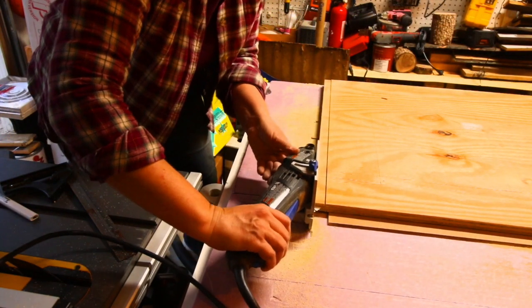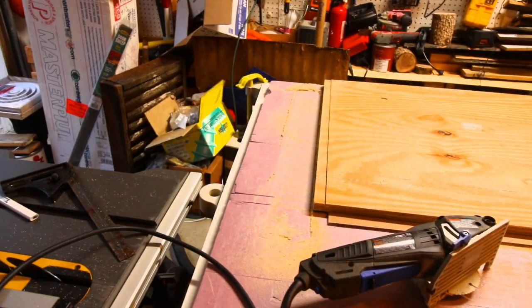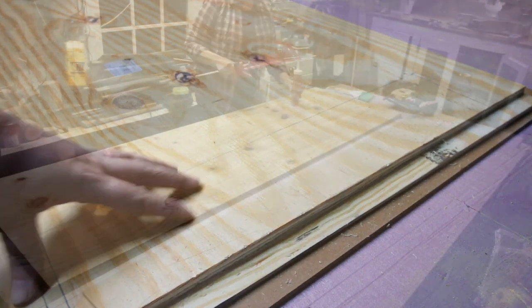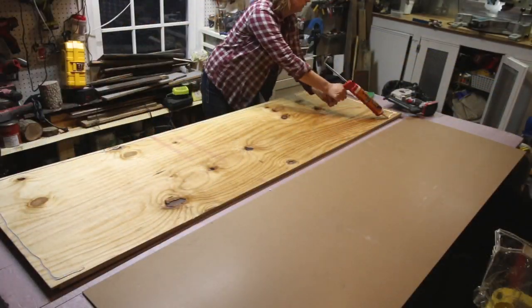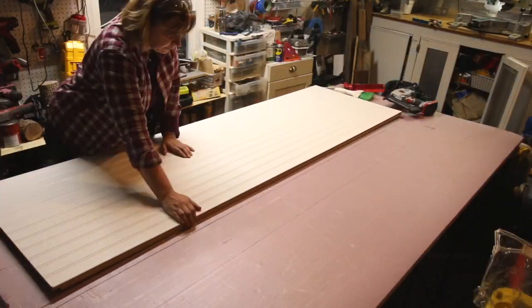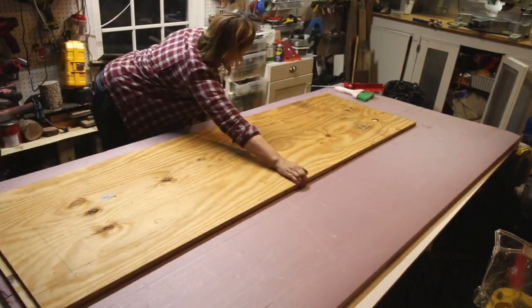The hanging hardware for my barn door has a small bar that mounts on the floor. I needed to cut a groove into the bottom of my door to accept the bar and keep it from swinging back and forth when opening or closing. Add a fair amount of construction adhesive to one side of your plywood door. Then lay the Masonite beadboard sheet onto the plywood and press firmly into the glue. Drive a few brad nails into the Masonite to keep it in place as the glue cures.